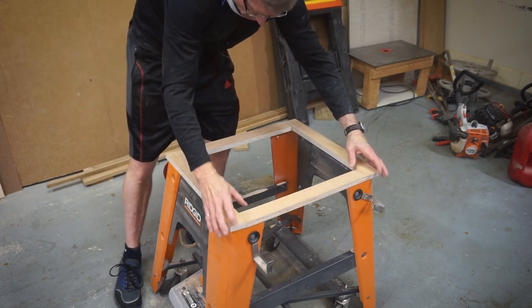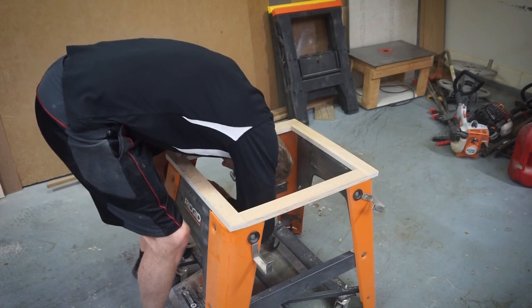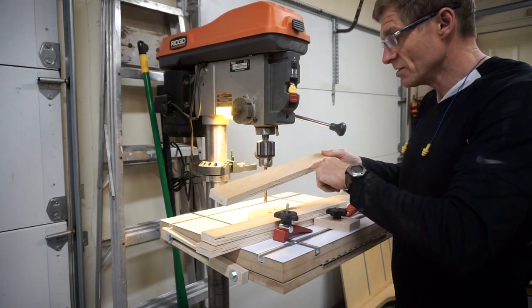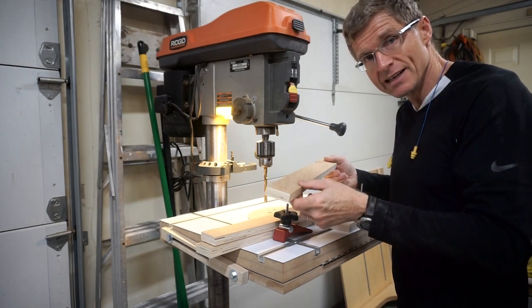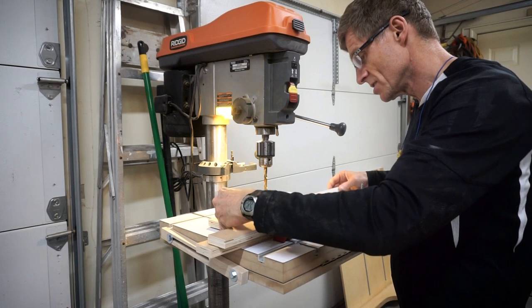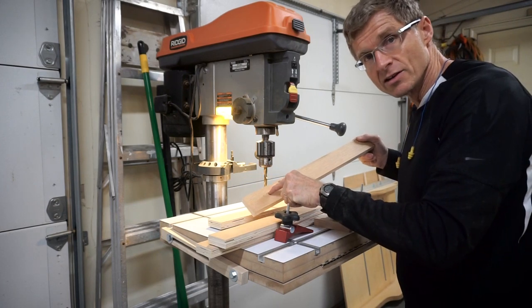That gives us a much better fit than those pieces. I'll just be careful that I don't move these while I'm marking the screw holes from underneath. I've marked the drill holes on the backs and also marked each piece with orientation so that when I put them back on the table saw base, I'll know where to position them. I'll drill three-eighths inch holes in those positions. I have a little flexibility because these are elliptical cutouts on the table saw base, so as long as I get the hole in there somewhere, I'll be fine.